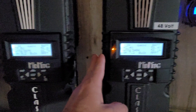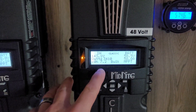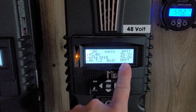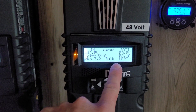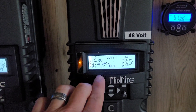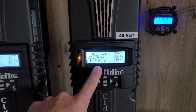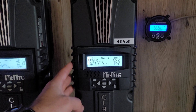This is the Classic 200, and this right here is the Classic 250. This is running the 12 320s on the roof. When this one hits a little higher than 58 amps it'll actually reach its limit, which reduces it. The roof array is putting out pretty decent — obviously these aren't fully optimized — so the 250 works good, but personally I think in the future I'm gonna change this one out to another 200.